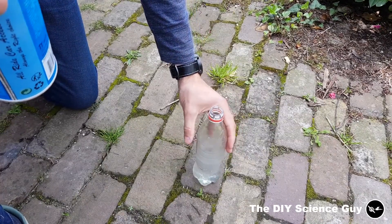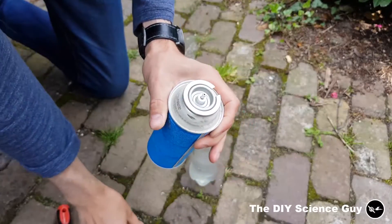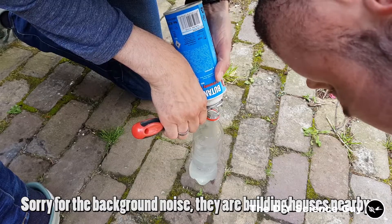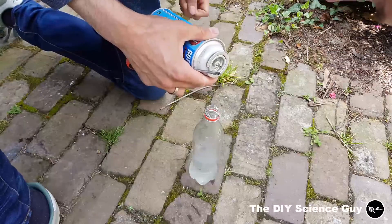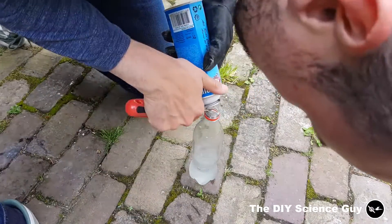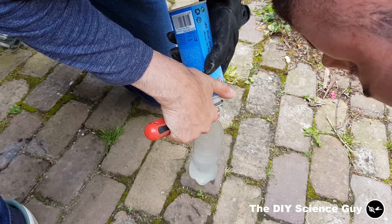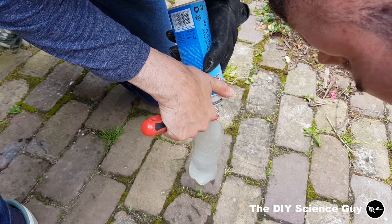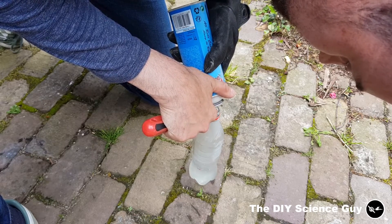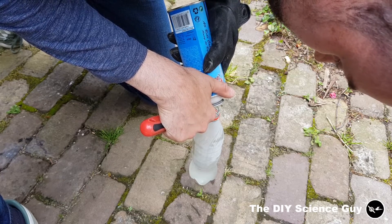Let's fill this bottle. I just put it in the freezer so it's very cold — way below the boiling temperature of butane. You can see that there's not much gas escaping because it's so far below its boiling point; it's just staying liquid. Which is of course safer and also means you lose less butane.